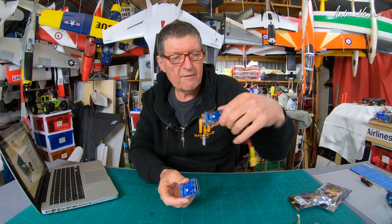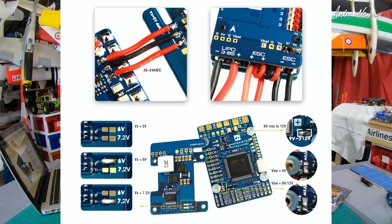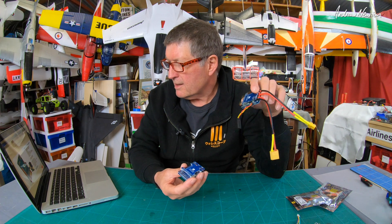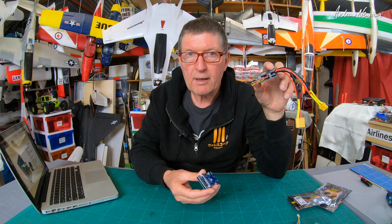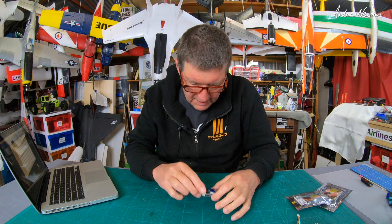Similar specs to the F765 Wing board, and in the same way you have to solder three little wires to connect the top deck to the middle deck. Input voltage is 9 to 36 volts DC, so that's 3 to 8S, with a 132-amp current sensor and three BECs. There's a 5-volt 2-amp BEC for the flight controller, a 9-volt 2-amp continuous BEC for camera and video transmitter — changeable to 12 volts via a solder bridge — and an 8-amp BEC for servos with voltage selectable at 5, 6, or 7.2 volts via solder bridges. We also get two camera switching inputs and can switch power on and off for one of the cameras, which would be good for turning an HD recorder on and off.